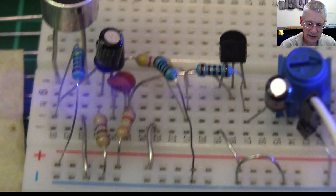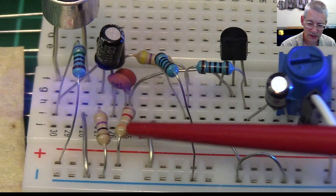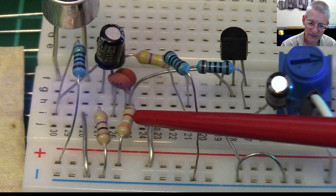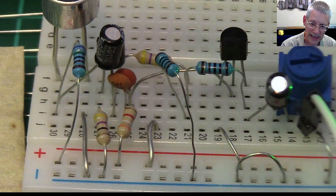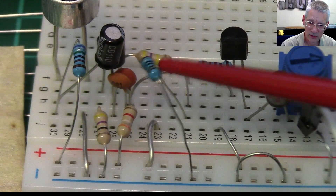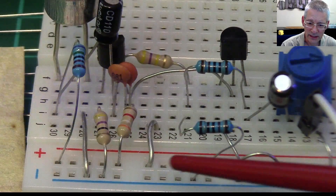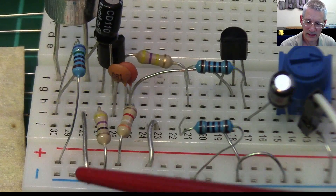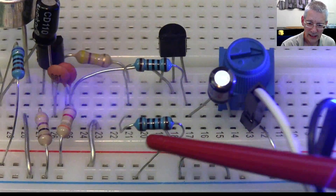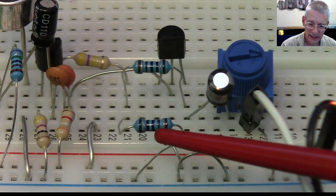Let me zoom in. Now here we've got some standard four-band resistors. This is a 3.9k — orange, white, red. This one is a 470 ohm with a gold tolerance band — five percent. That one at the back starts with yellow: 470k. I can tell all those at a glance. But this five-band one I'm touching now — the blue body doesn't help compared to these beige-bodied ones where colors really stand out. On the blue body it's muddy color, slightly less muddy color, muddy color again — and I don't know which end to start from.